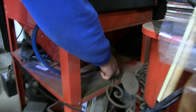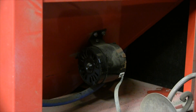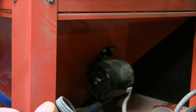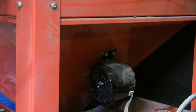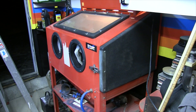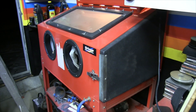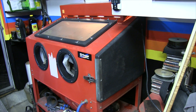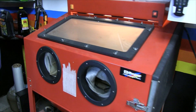So what I did was use a little bit of sand, and I went to Grainger and bought what they call a vibrator motor. It's just an electric motor, 115 volts, with a counterweight in it so it just shakes when you turn it on. It came with a switch right in line on the wire. I mounted it to the funnel so it vibrates the funnel and keeps the sand moving down to the bottom — that was the key first modification. You still get debris in the pickup tube and have to back-blow it, but at least the sand feeds into the dip tube consistently.